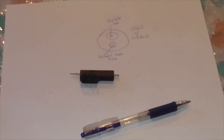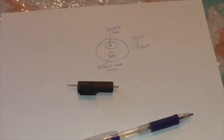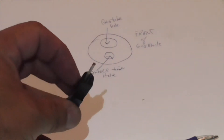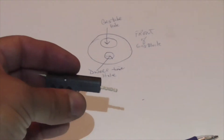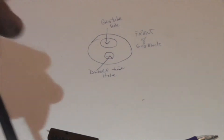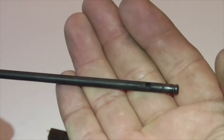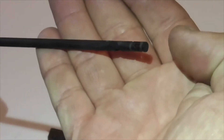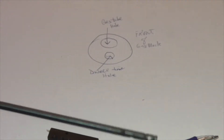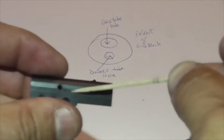Really quickly, I wanted to add in the gas block itself. It's too difficult to get the video camera to focus down the front section of the gas block, but essentially that Allen head goes through the front. What I have this toothpick doing is just showing you this top hole here, which is where the gas tube itself — as I mentioned — is closed on the end. So you have the gas port hole in the gas tube, you have the pin where the roll pin goes, and there is no gas interface with the gas block. It's a non-adjustable setup.